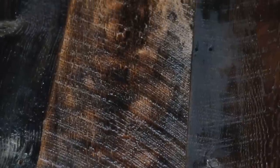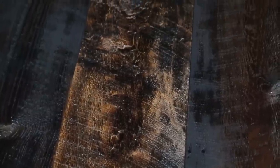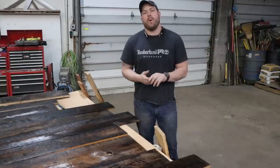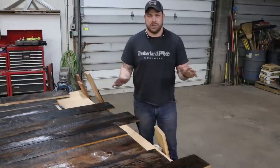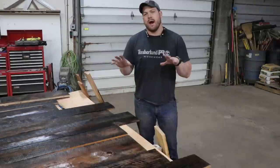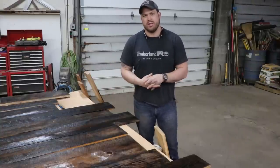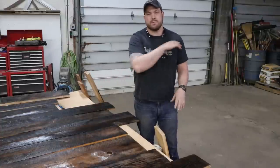I went from a few different species here — you're seeing poplar, pine, hemlock, and oak — and they all blend together pretty nicely, which is awesome. When I'm doing something like this for paneling, it makes a nice uniform look and I can use up a bunch of different varieties. When building furniture I tend to use the same hardwood if possible because of wood movement. This is a really simple way to get an awesome finish on any type of wood. It's kind of like a hybrid shou sugi ban — I don't fully burn the wood until the oils come out and seal themselves like that shou sugi ban finish does, but it does give a cool, uniform look across multiple species of reclaimed wood and helps those saw marks really pop.